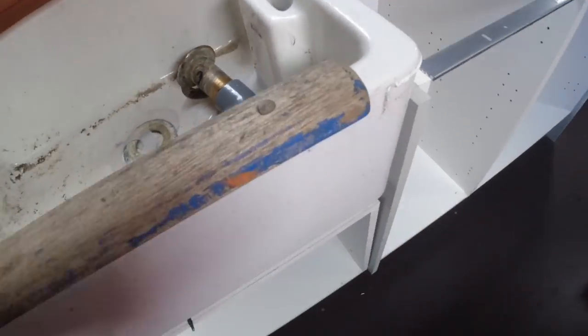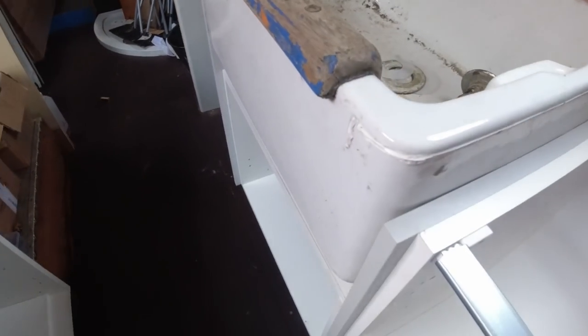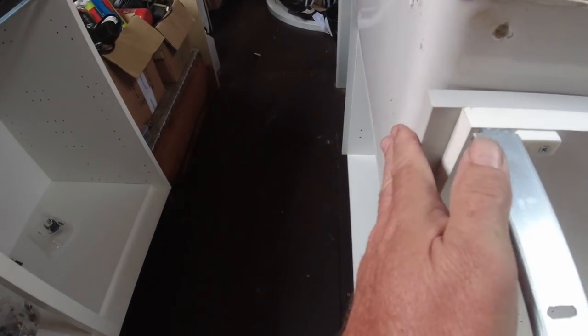So what I'll probably have to do is, once I put that lot in, cut a bit of a hole under here. You can see the light shining through the sinkhole, so I know roughly where to cut. I'll cut a bit of a hole in that board, and that'll allow me to go a bit deeper into the box underneath. And then I'll keep the sink this exact height here now with these three bearers each side. And if you can see the ones that side, there you go. I'll glue them together, tidy them up, make them a little bit bigger, so they fit almost flush to this side here, look. And then I'll put a little false front on here, and I'll try and get the sink to fit flush. When I do the worktops, the sink will sit flush with the front of these, pretty much as it is now actually. That's not too bad.